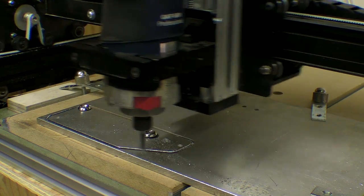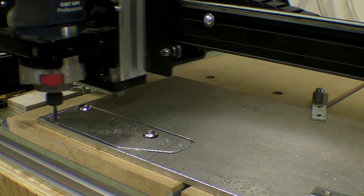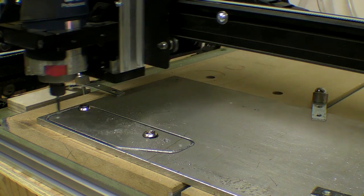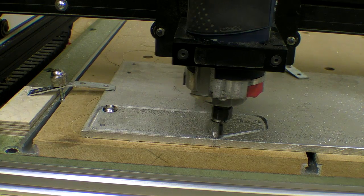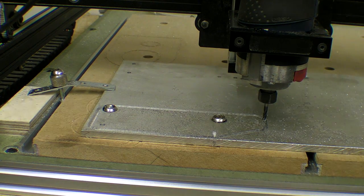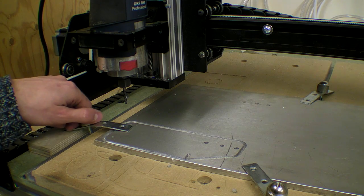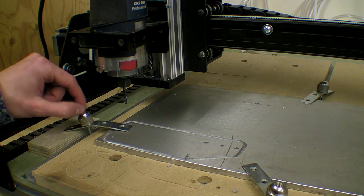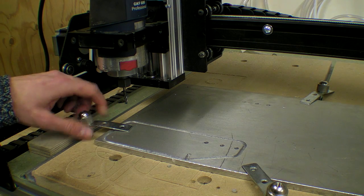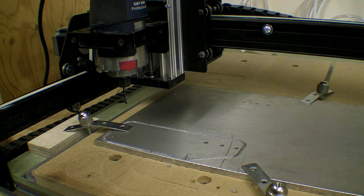I realised what I did wrong previously — I basically put an extra zero on the feed rate, which meant it went like a rocket. But it seems to be cutting quite accurately despite that monumental cock-up. Considering how fast it was going I'm amazed it managed to cut as deep as it did. The chip load was just so high it clogged up the flutes and then pulled the bit into the aluminium — and it didn't break the bit, which is surprising.